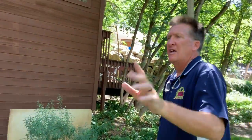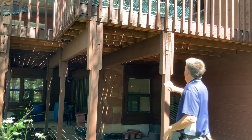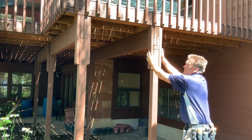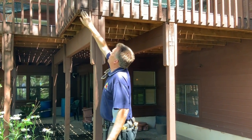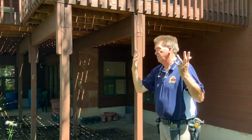The finish on this is kind of rough — it's all sun. Notice once again, this is treated lumber and this is non-treated lumber — that's the old one. This one is sistered with treated. They came through and spent a lot of money. There's still some old decking on there. The spacing is four inches, which is the way it's supposed to be — that's code. They're in good shape.